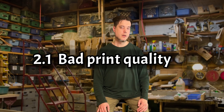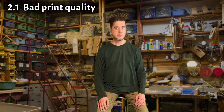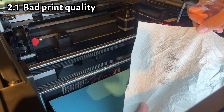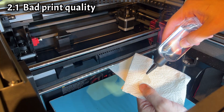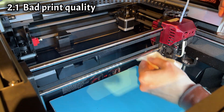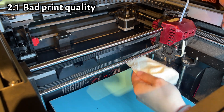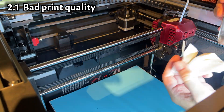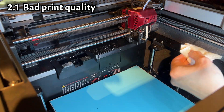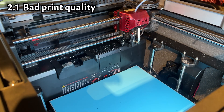Important improvements: bad print quality. Not everyone has this issue, but I did for a full month when I got my Plus 4. The X rod or its linear bearing seemed to be sticky from the factory already, disturbing the toolhead movement. I solved mine by generously lubricating the X rod with sewing machine oil — as it needs to be a very light oil — moving the toolhead back and forth by hand, wiping the black buildup, and repeating the process until no more black came out. This simple trick improved the print quality on my unit significantly.